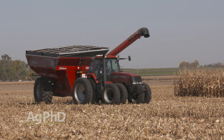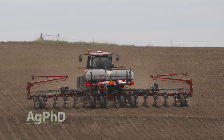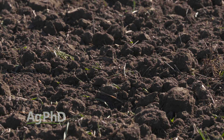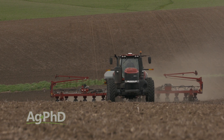The first thing with precision planting is just the down pressure — it really can vary as you go throughout the field because you might have heavier soil or lighter soil. You might have areas where you mudded the crop out last fall, or drove a grain cart across the field and created extra compaction in a certain spot. That down pressure needs to vary based on soil conditions, and that's something your planter can now do for itself — it's pretty awesome. There have always been manual adjustments, but how often were you jumping out of the tractor and making big adjustments every time you switched soil types? Nobody was doing that. We're lifting more often than we're pressing down harder, and it's made a huge difference for us.